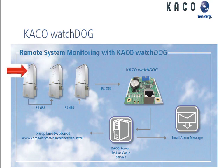If you use the card in the middle because of the setup, that would be your host or master. They always have to be daisy-chained together — you can't jump around because the card wouldn't know which data is which; the data stream would get lost. The card sends data to our server and you get an email alarm, accessible through the SolarEdge hosting website.